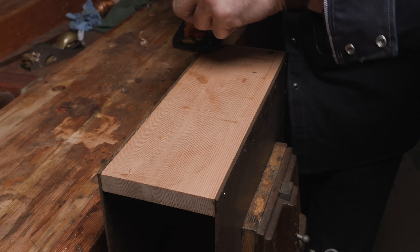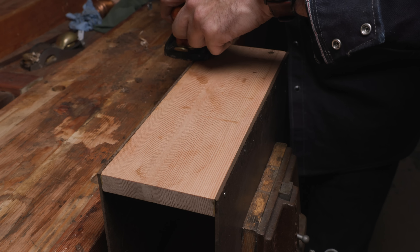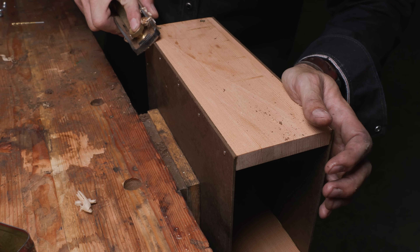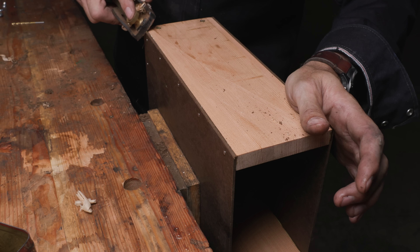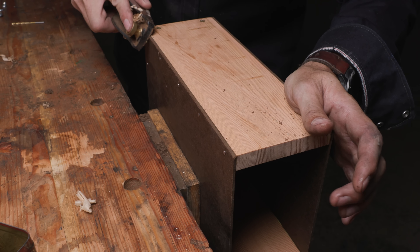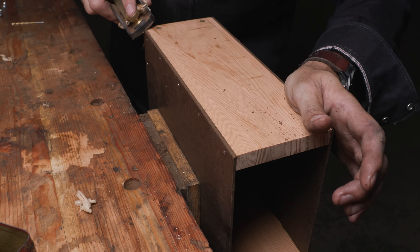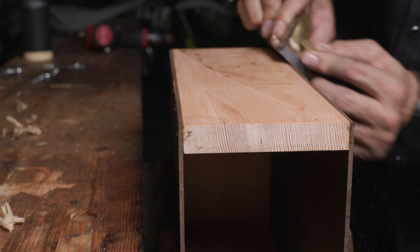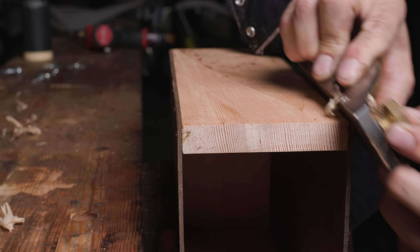To flush up these seams, I'm going to use my bench plane — just be careful not to get that blade near those screws. I noticed on the original the carpenter had cut a bullnose on these corners, and that's a really good idea. As tough as this hardboard is, the corners are vulnerable to getting knocked off. Anything that's going to be banged around and thrown in the back of a truck while camping — you don't want those hard edges. If we can relieve those, it'll make it last a lot longer.